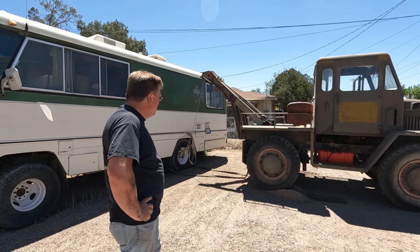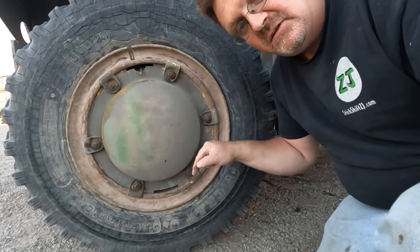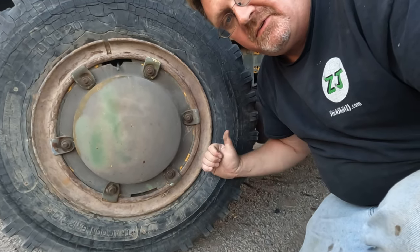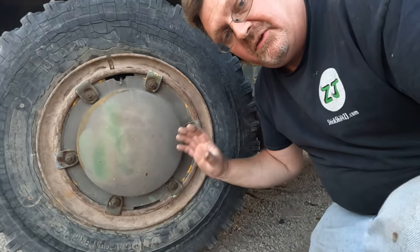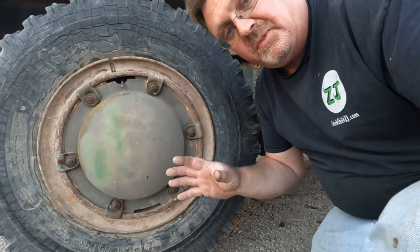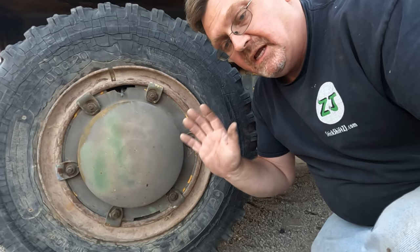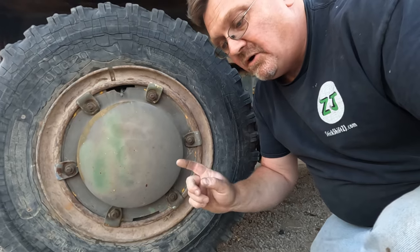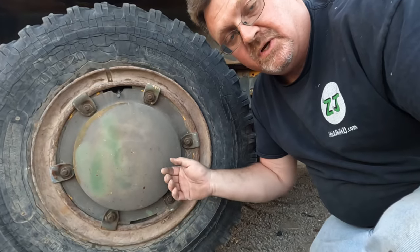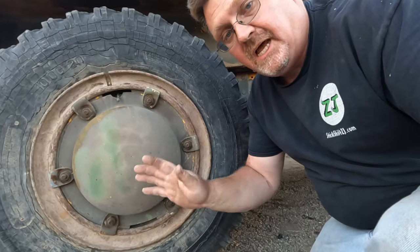Apparently there's a little bit of a learning curve with this. What I discovered is as soon as I dig holes, you're no longer pulling straight forward — you're now trying to lift up. The tire is actually pushing the whole vehicle up, and if you have a lot of weight in the back it has to lift all that weight to get out of the hole. The thing I learned is that basically as soon as the tire spins and starts digging, I have to stop. There's no way I'm going to pull after I dig a hole. So I have to stop and reposition — which is easy especially with the rear wheels turning, I can just drive sideways and realign myself. Once I dig a hole, just stop and do something different.